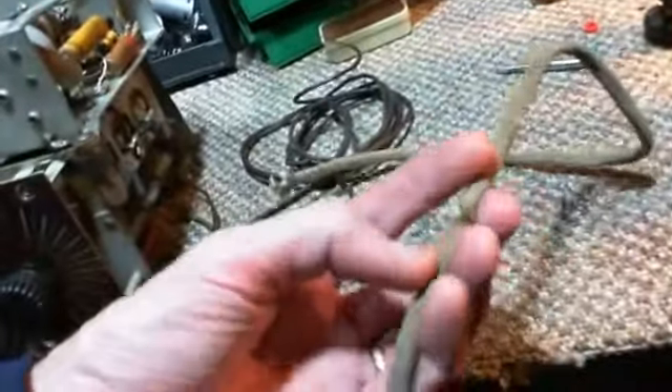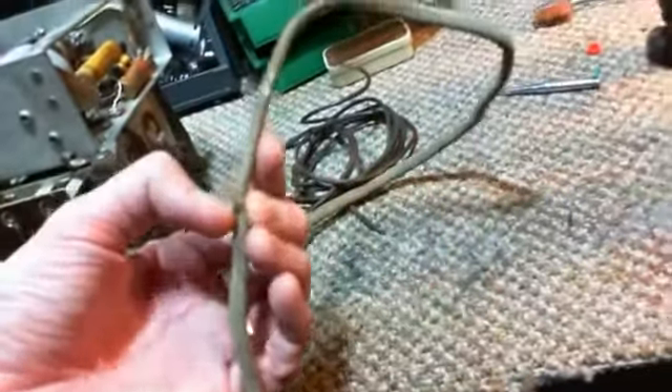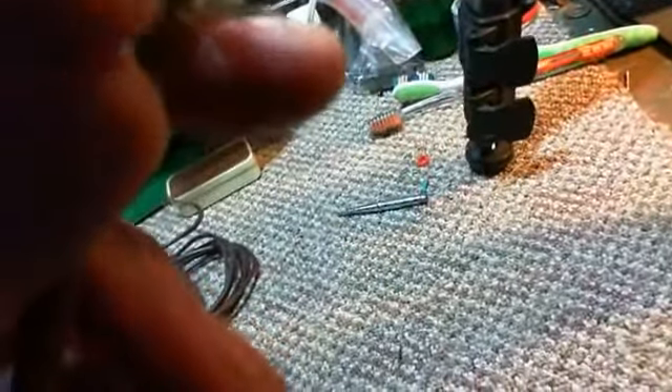If it was mechanically sound I might consider it, but here it's not. There's a few other spots like this where you can't rely on the wire not being twisted pretty hard right in there. And since the insulation here is crumbly, it could be crumbly anywhere along there. I'm going to get a short circuit. I don't want that. So no need to keep this particular cord.